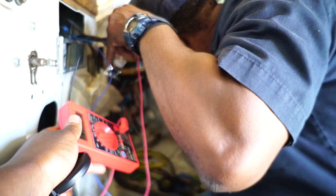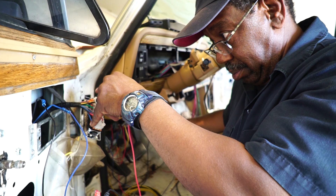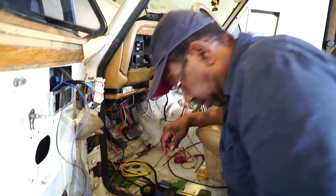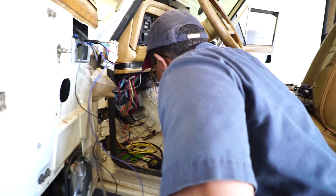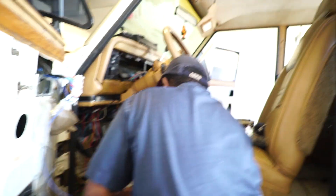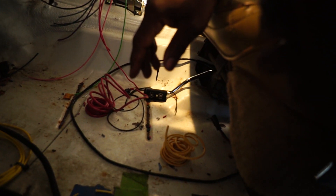We figure out it's not moving properly — there's no ground. There's something wrong with the ground connection. We trace the wire: it's supposed to be hooked up in the corner, but it turns out it got pulled off. That explains all of it.